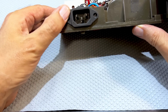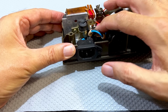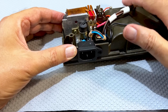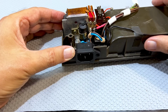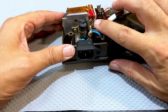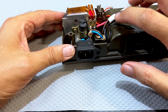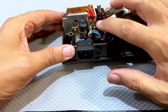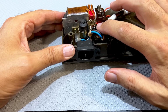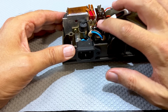So what I decided to do is I had to make this a bit safer and I had to correct it. So I corrected first the transistor and got the regulator working so that we can actually send the required 7.5 volts to the radio. And also one other thing, the positive is sort of ground at this point, and they regulate the negative side of the supply. So the pass transistor is a PNP germanium, and it is regulating at the negative end and not at the positive end. It seems a bit strange, but it's the same thing.